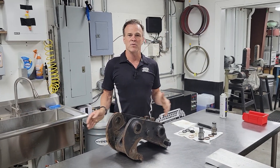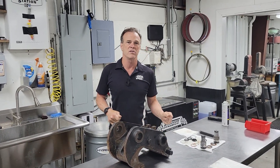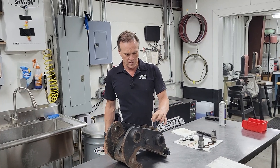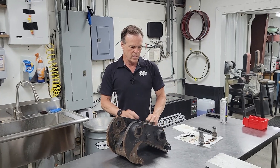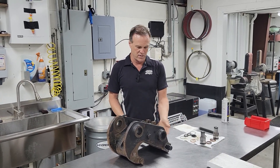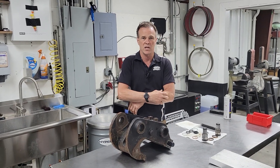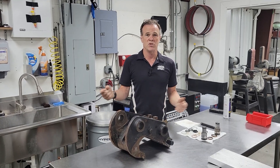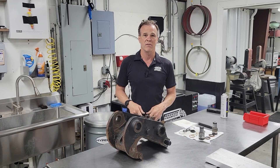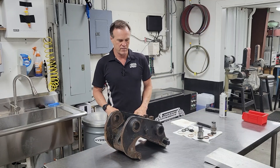I have seen where people suggest that you can do this on the machine. That's nothing I would ever attempt, because there are little tiny hydraulic passages that pass through this swivel that's on here. Any dirt and debris that gets down in here can block those passages. This is something that should be fully disassembled and cleaned in a workshop environment before you start assembling anything. There are people who suggest retracting it in the field, pulling the clips out, and letting it pop the pieces out, shooting them into the dirt. I think that's kind of absurd.